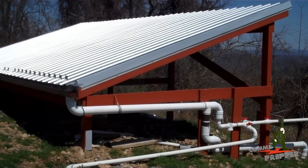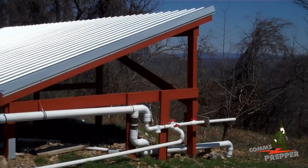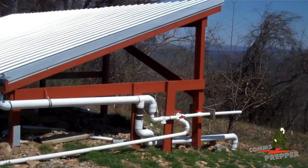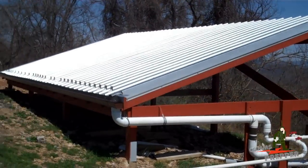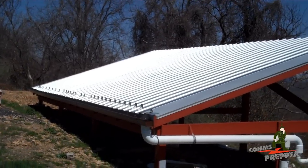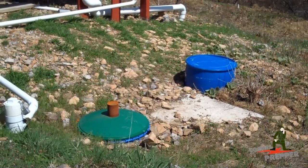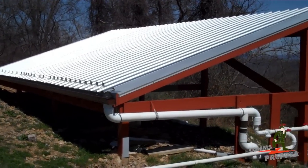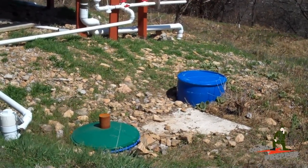Hello YouTube and Preppers, this is the Comms Prepper with one of the Comms Prepper helpers. Hey Preppers. We're up at the retreat location this weekend and we're going to go live with the rainwater harvester. Over the winter I plumbed up the first tank here — that's a 1,500 gallon cistern tank. We're going to connect the spin-down filter, put the drip valve in, scrub and wash out the gutter, spray it with a little bleach, hop down in the tank, and fix one leak with aquarium safe silicone. By the time we leave this weekend, we'll have the harvester ready to collect the first rainwater and see how this project works for a full season.